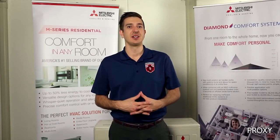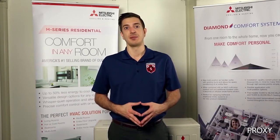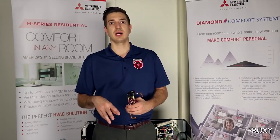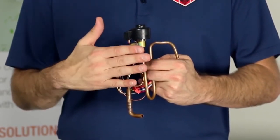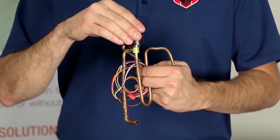The LEV is what we use as our metering device. We're going to take a look at some common problems you may see in the field, as well as some ways to prevent it from happening. The LEV acts like a magnetic field — it either spins counterclockwise or clockwise to open or close the refrigerant flow. The coolest part about it is that it's a two-piece component, a body and an LEV coil, which means we can actually remove the LEV coil without having to touch the refrigerant.